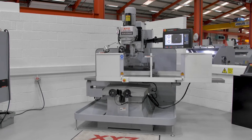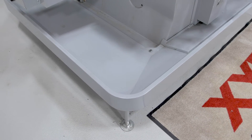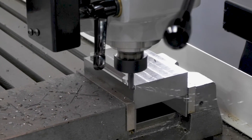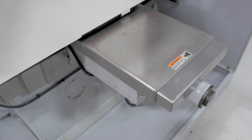The RMX5000 is a solid cast iron machine with induction hardened boxways, giving the base a massively rigid construction, with 1524 millimetres by 596 millimetres by 584 millimetres travel in the X, Y and Z axes.